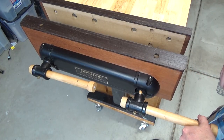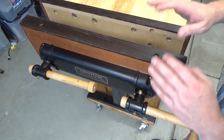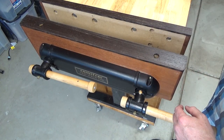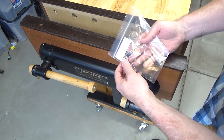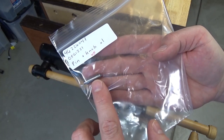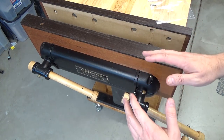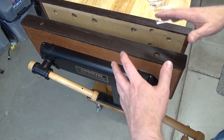To re-sync them you just allow the pin to snap back in place and then they'll operate together. One great thing about this vise system is that the installation instructions and manual are available from the Veritas website. While reading the instructions I realized I was missing that part, and also missing the extra shear pin. The vise comes with this extra shear pin because its job is to break off if you over-apply pressure on the screws — that's sort of a protection system against damaging the rest of the system through over-tightening.